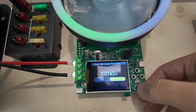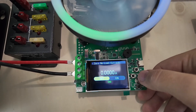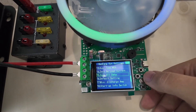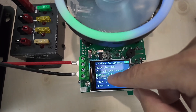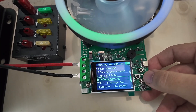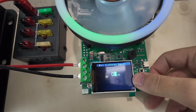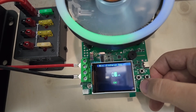No load current — we're going to leave that off. Zero all data is something I'm going to need to do every single time I start a new test, because you don't want the cumulative battery power consumed in the last test to add to this test. You can also return everything to default, and then it will do mini discharge — you can go down to 0.5 milliamps or up to 10 milliamps.